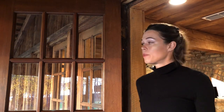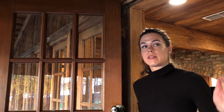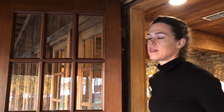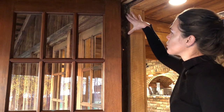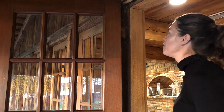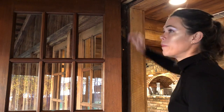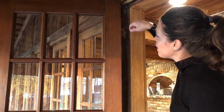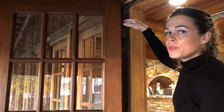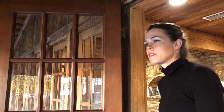In this case I did need the level because I needed to know which of these two doors was still having the sticky problem. It let me know that I had the other door leveled and this door was not level. So you'll want to screw in somewhere in the top area of your door frame, and you will want to pre-drill a hole — my hole is already pre-drilled. Make sure that you don't pop through on the other side and make a hole where you don't want one. In my case there's plenty of wood here, so we're fine.